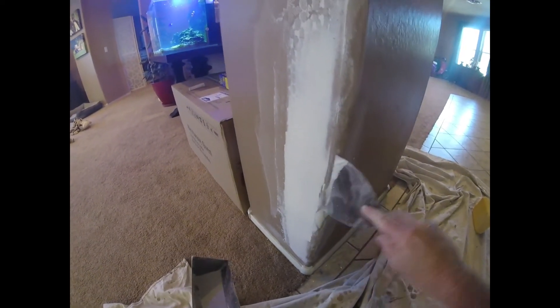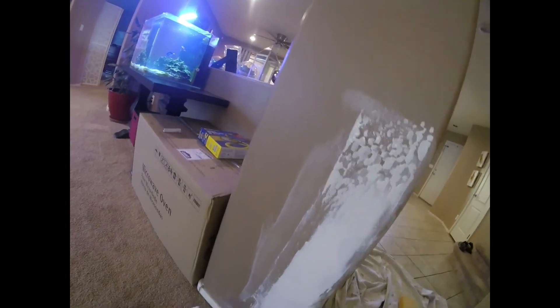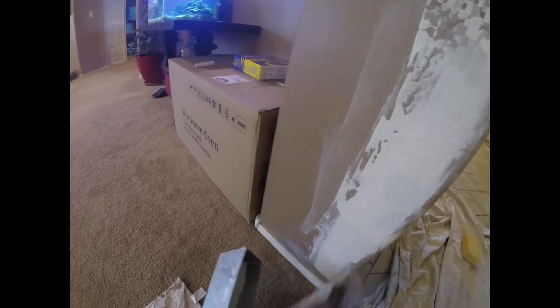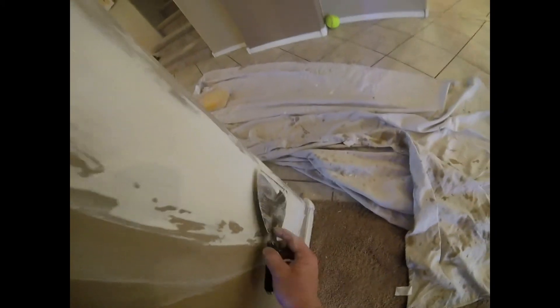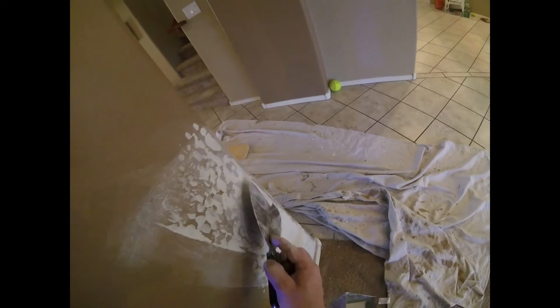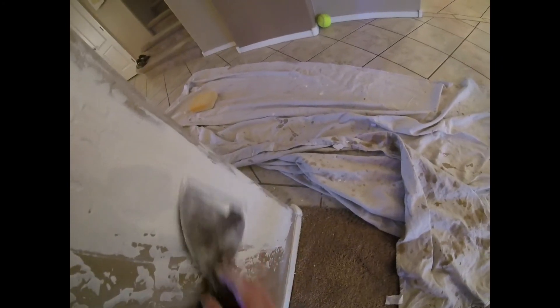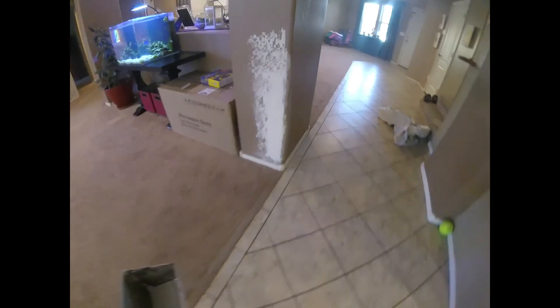Follow through on the other side — same thing, filling in the corner bead, just filling in that ding with a fresh coat of joint compound over the hot mud for a nice perfect finish. I see what direction the skip trowel is going and I just skip, skip. This is regular joint compound I'm using. There are powder-form textures, but on these smaller field jobs I just use regular joint compound thinned down. I feather it out and blend it into the existing texture — that's it.